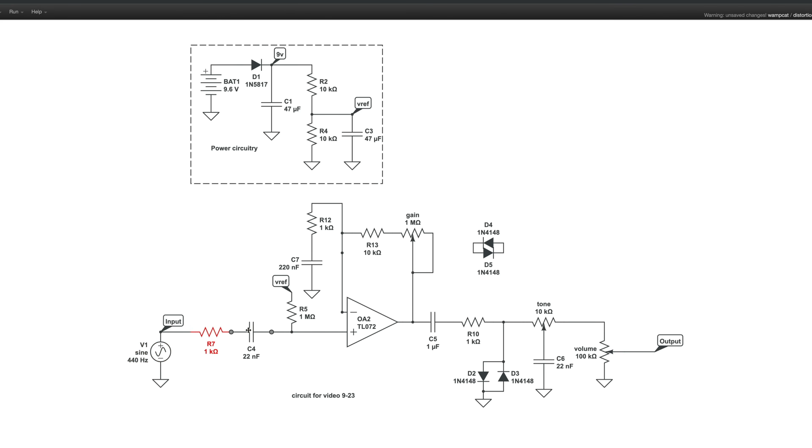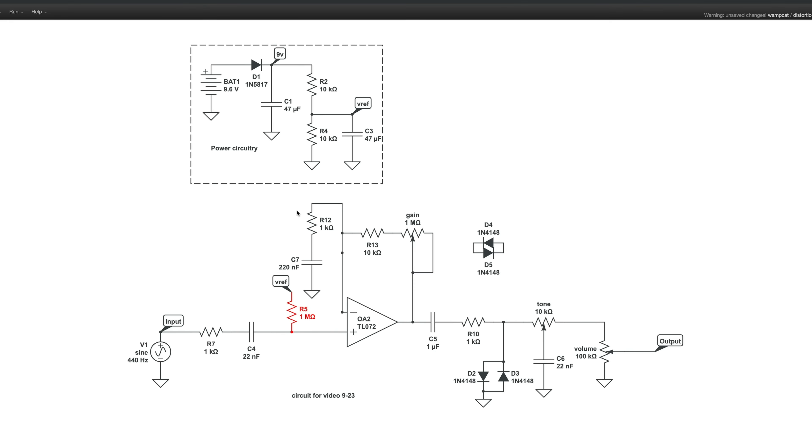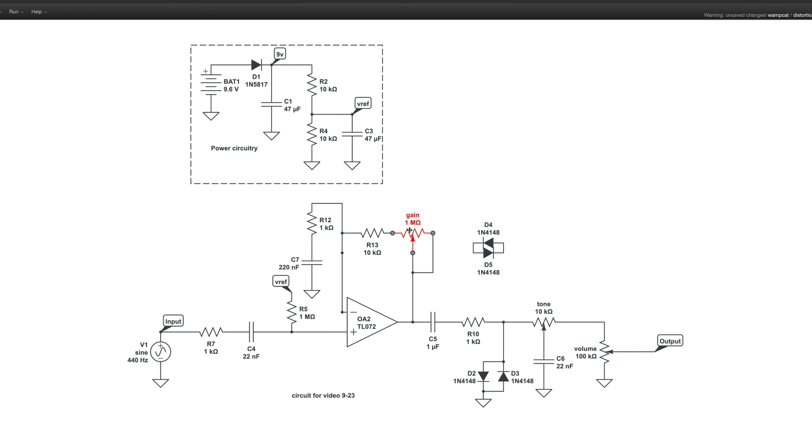Let's look at this circuit real quick and we'll see what's going on. So here we have the signal - this is the signal generator acting basically like a guitar. It goes through a resistor, it goes through a capacitor. This little resistor here is just simply for biasing, which means making the op amp work like it should. Now, this area here is where the magic happens - this is going to be our gain control, with a little bit of a limiting resistor so I don't want it to go all the way to nothing. This resistor and capacitor will tell us what frequencies we're going to boost and how much gain as well.